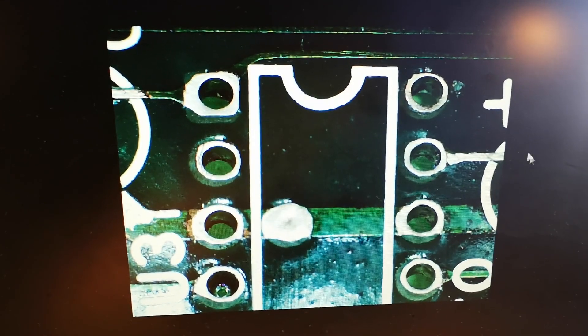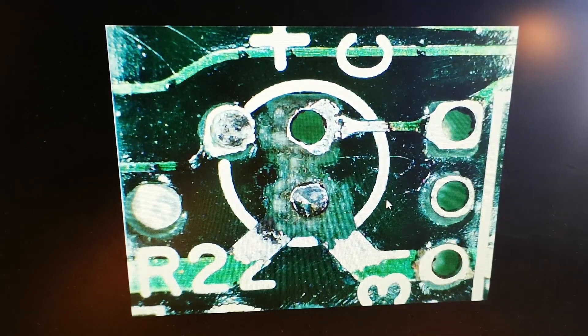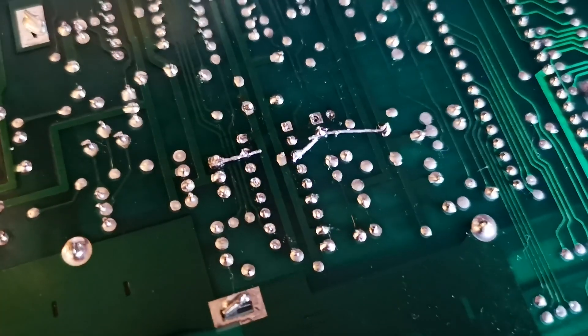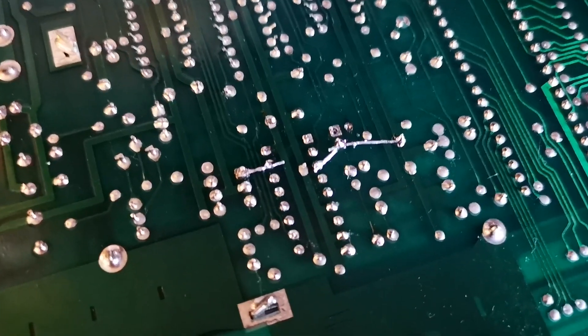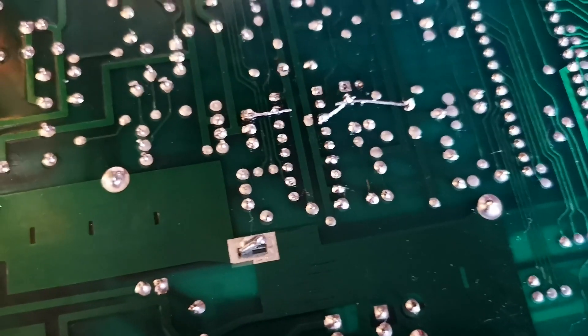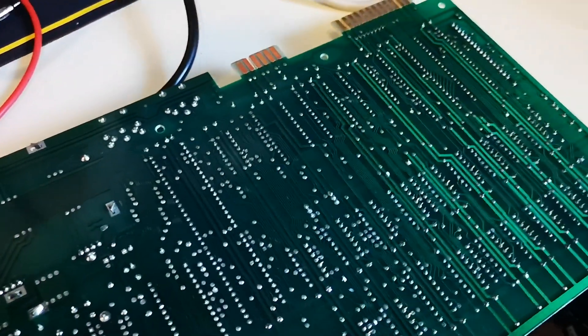There's a break over here, and here you can see it's completely corroded. So this is the fix — I had to rejoin some traces and then it works. I also had to replace that chip. But now I'm going to remove all the devices here, which will take weeks probably.